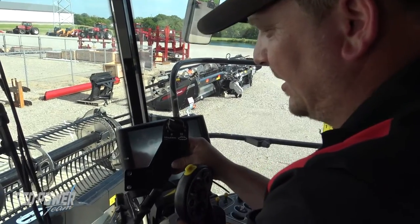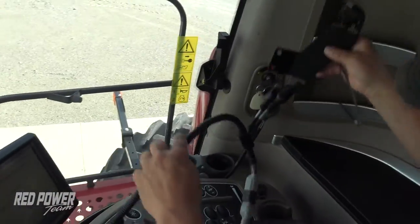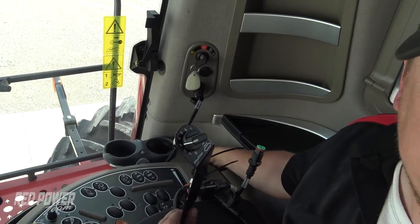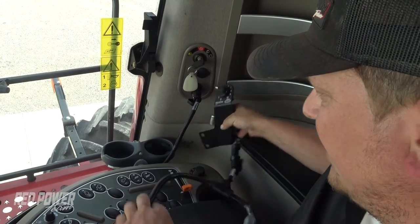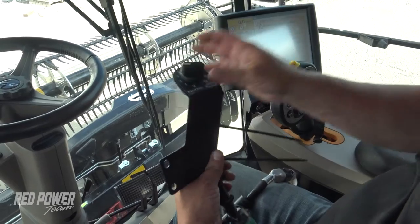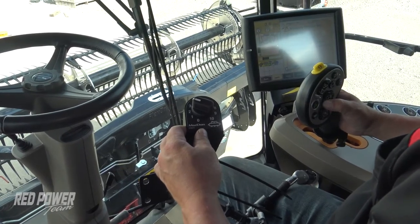This is our side draper speed adjustment. This bracket is going to get mounted clear back on this back right corner. We're going to use the bolts that are in the backside of this rail in order to mount this back there. While I've got it sitting right here in my lap, we've got our three-pin power plugged in back by our key. We're going to function test our side draper speeds just to make sure that everything is working the way it should.